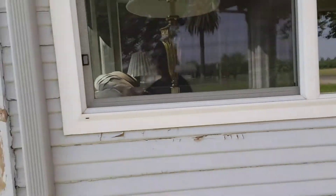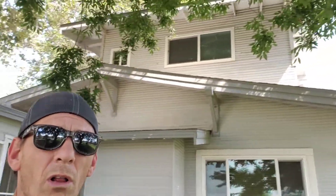There is quite a bit of prep work on this house, which is why the bid is going to be higher than most projects of this size. After walking it and figuring it out, I'm thinking we're going to need about 30 gallons of paint for two coats. We're also going to have to put a peel stop product on there, which bonds down all that loose material. We'll scrape and knock down all the loose stuff, sand it, treat it with the peel stop, and probably put a primer coat on it as well. It's a pretty big house.